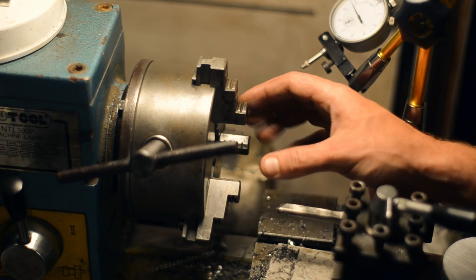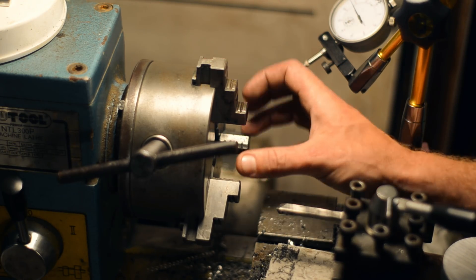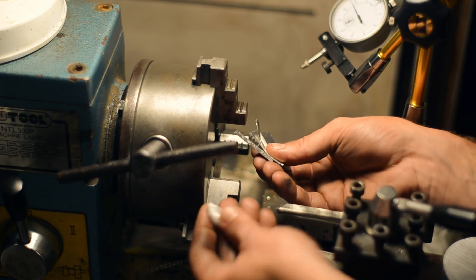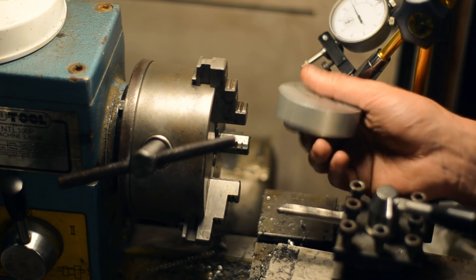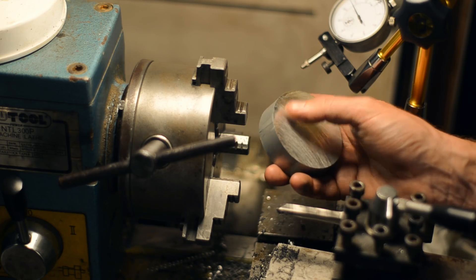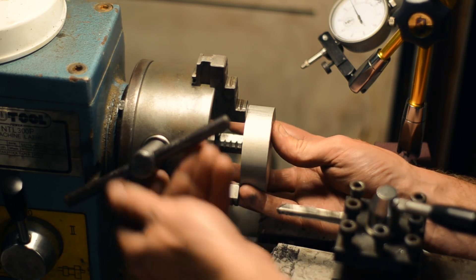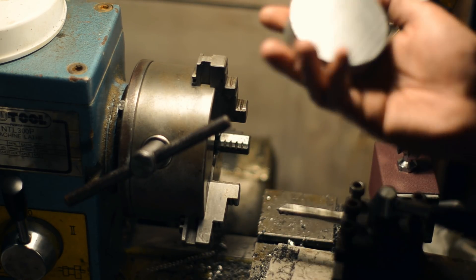I need to flip that pulley and do the features on the other side of it. All I own is a three-jaw chuck and it's a 22-tooth pulley, so it doesn't add up. I tried using some shims to shim out the runout but it wasn't satisfactory. I cut this round aluminium piece — the plan was to bore out the inside to fit the pulley teeth and slit it and use that, but I can't fit it in my chuck; if I try, the jaws will fall out. So, Plan B.